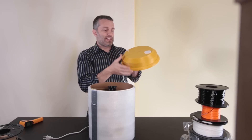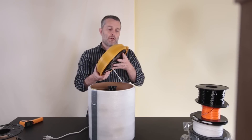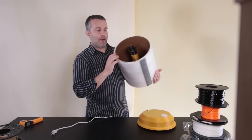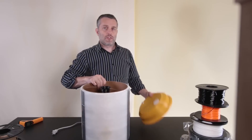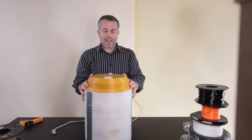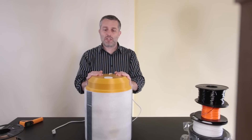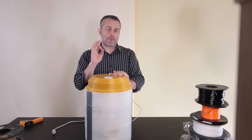I took the guts out of the food dehydrator — the heating elements and protection — and printed an outer shell out of ABS, the same plastic the original was made from. There's a tube with a TPU printed boot that seals to the lid. Hot air blasts down the tube, pops out the bottom, circulates up the sides, and gets sucked back into the heater fan element through side vents. The design works great for airflow, but it doesn't get hot enough — I need to go from around 148–150°F up to 212°F.